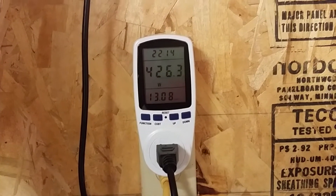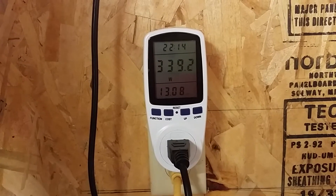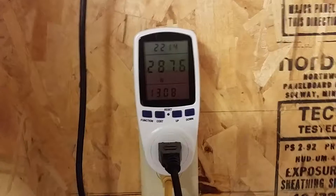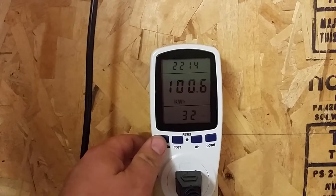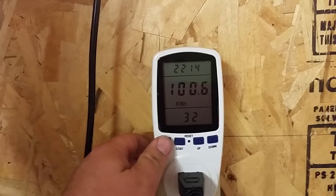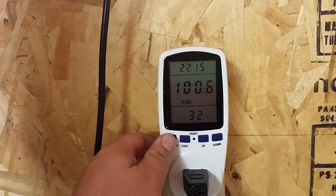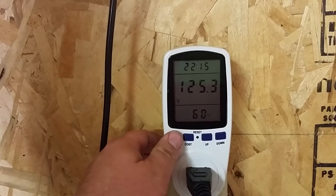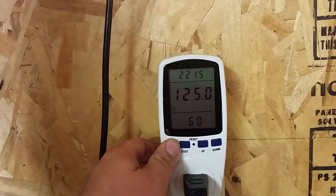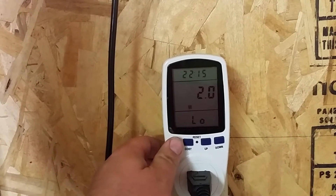We're going up to 450 watts — we've got clouds passing through, so that's about it. We'll go through some of the functions: 32 days, 100 kilowatt-hours. Again, this is Labor Day 2014 and we're in northern Wisconsin, so the angle of the sun is going to start changing pretty significantly. Reading 125 volts and looking like about 3.5–3.6 amps.